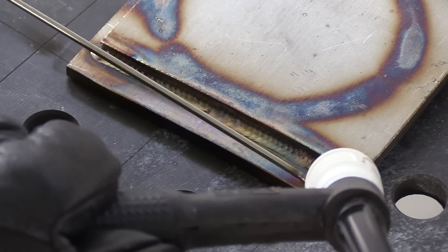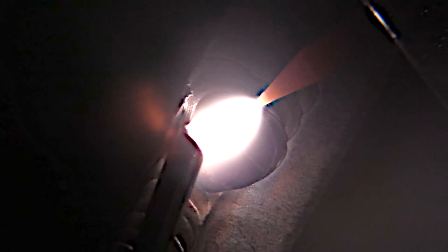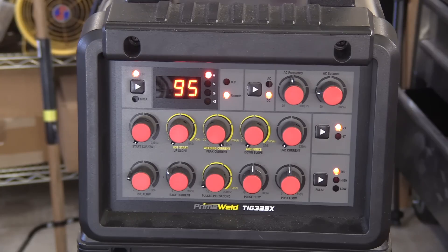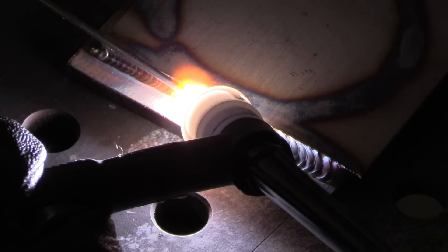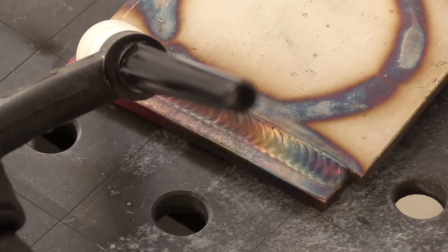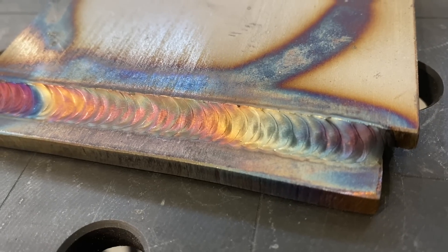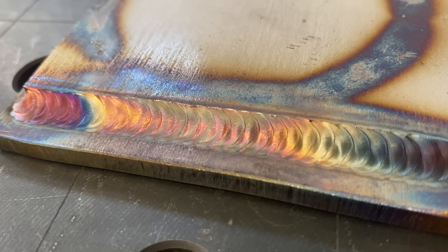This cup is a great choice for stainless steel as well as 4130 chromoly. I bumped up to a 3/32 diameter filler metal for this second pass so I can use a lay wire technique and weave over top of that first pass, just filling it into that corner. For this pass, I only needed about 95 amps. This is 304L stainless steel, quarter inch thick, and I'm using 3/32 308L filler metal. You wouldn't always have to put a second pass on metal this thickness, but if the drawing called for a quarter-inch fillet on quarter-inch thick metal, you'd have to fill it right up to that corner.